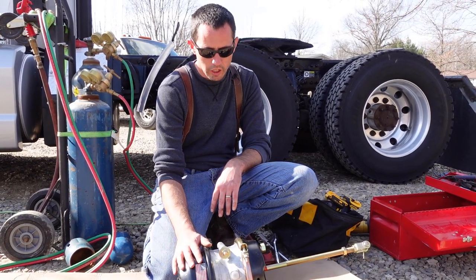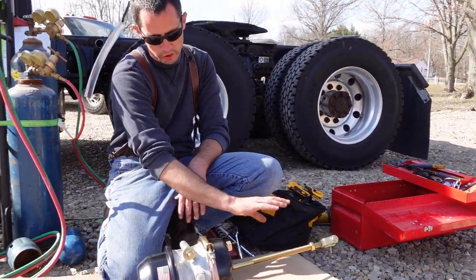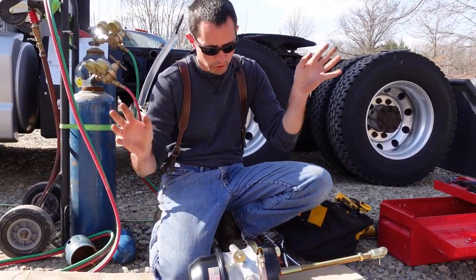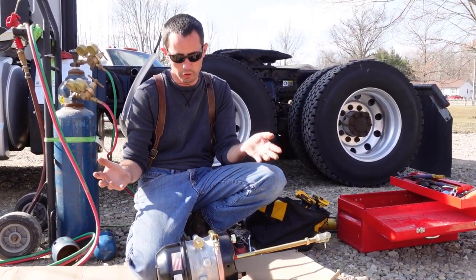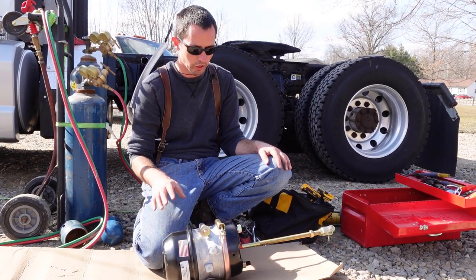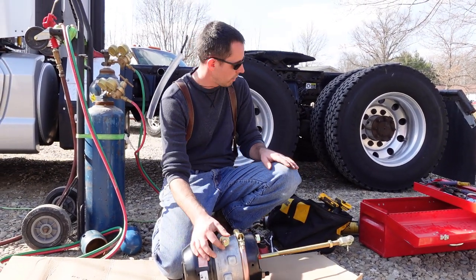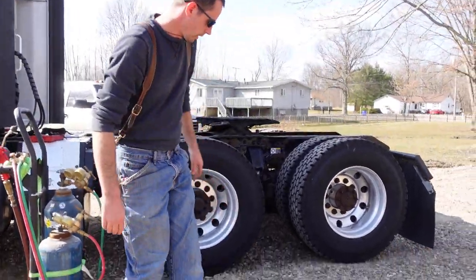So you don't want that spring coming through the side of your skull or something, so just don't mess with it. But again, I see a lot of videos and they're changing the whole unit out, they're cutting the rods, and you don't have to. If there's nothing wrong with this, you don't have to do all that. You can make this turn into a 10 or 15 minute job basically just by changing out the piggyback section.